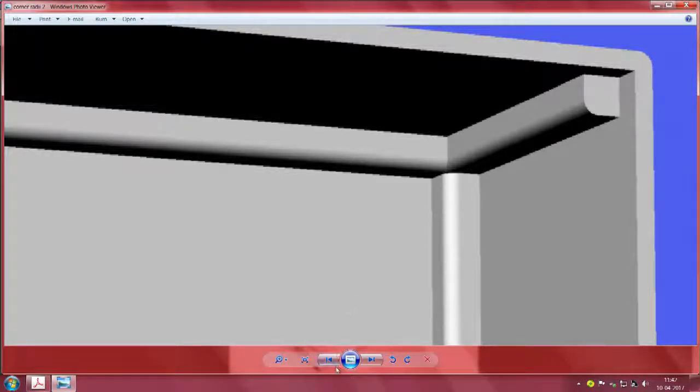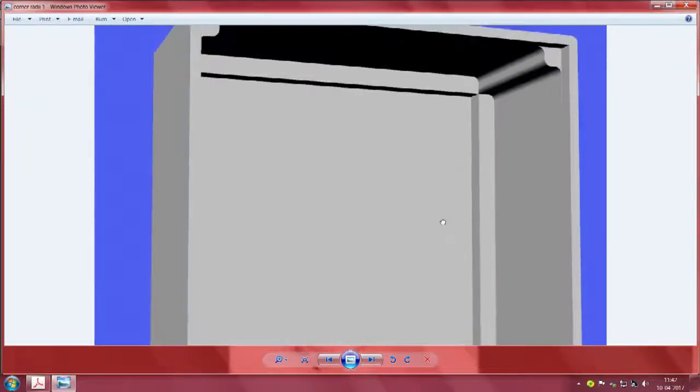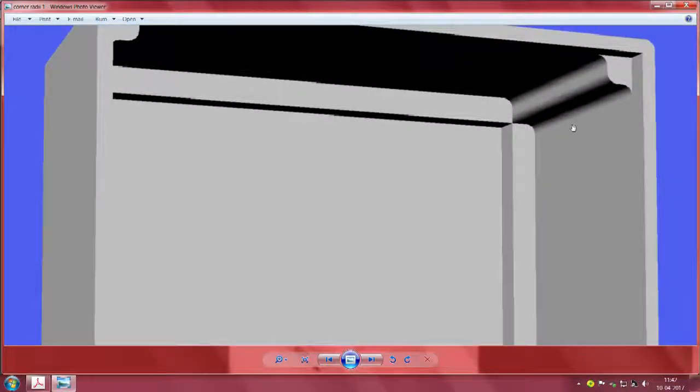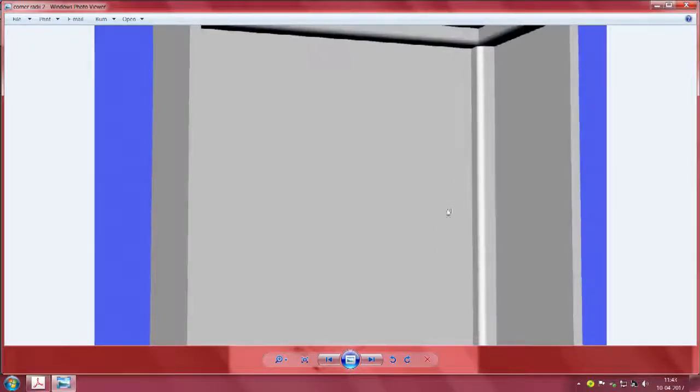The filleting in the previous thing was required because, if you do not fillet it in the mold, this is a good point for a crack to start forming. Crack, not by any other thing, whenever some stressing is done, wherever a change of section is there, chances are the crack will start. So imagine there is a force coming on this trying to pull the part apart, then the crack is likely to start here. So in that condition, that filleting is required. But however, in our case, in the normal case, you very rarely do that.